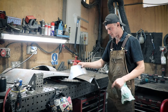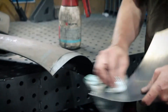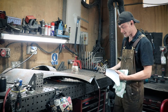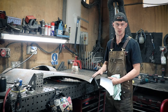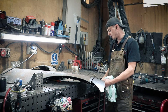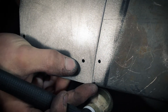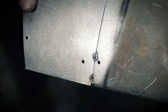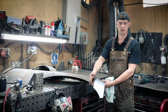I've cleaned up both panels and before we get welding I'm going to degrease them so it doesn't contaminate any of the welds. The tacking process is straightforward — we've got our two edges nice and straight and filed so we know they're going to fit up really closely together. We're going to start with one tack on one end, and the second tack will pull the two edges nice and tight together as it shrinks. Then we work our way all the way along to the end.